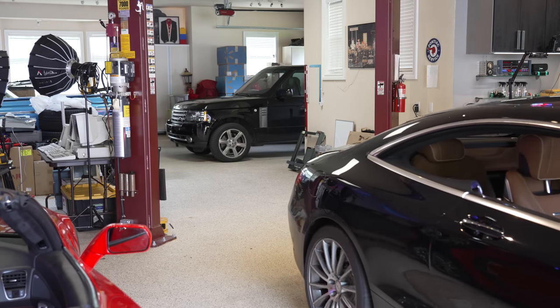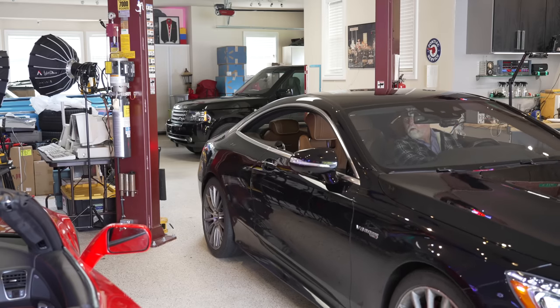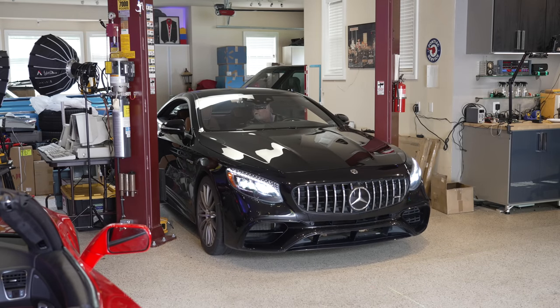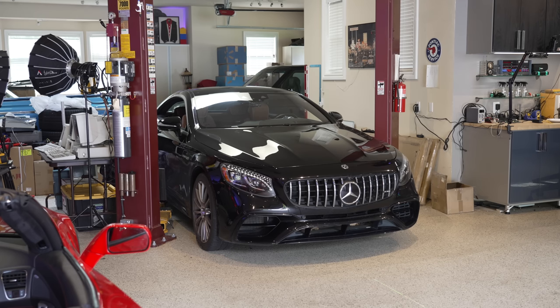Let's jump right in by trying to lift my car. I carefully backed my car onto the lift — this car is no lightweight, tipping the scales at over 4,800 pounds. The lift is powered by a hydraulic pump spun by a large 240-volt electric motor rated at a nominal 12 amps, which is just under 3,000 watts on paper, so it should be well within the limits of the Delta Pros. The problem, however, is that motor ratings are for once the motor is up to speed. There's a second rating called locked rotor amps — the load the motor pulls briefly when starting from a standstill — and it can be several times the running amperage. If that spike is, say, 40 amps, we're going to be demanding almost 10,000 watts at peak when we hit the button, which is outside the range of what the Delta Pros can supply, and unlike a mechanical generator there's no flywheel to momentarily steal momentum as potential energy.